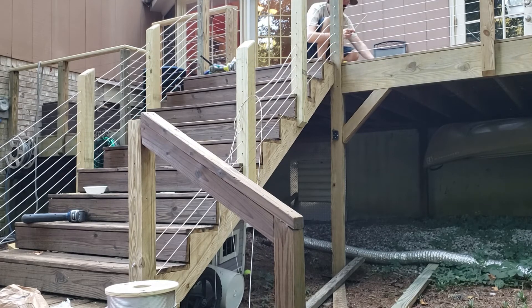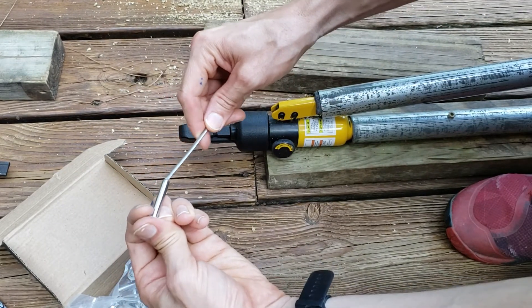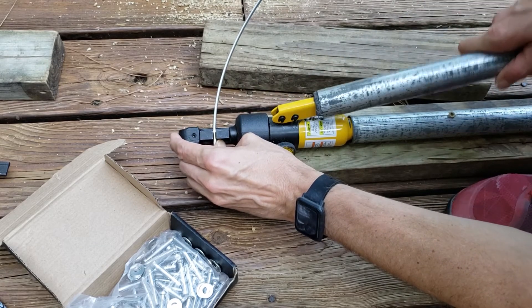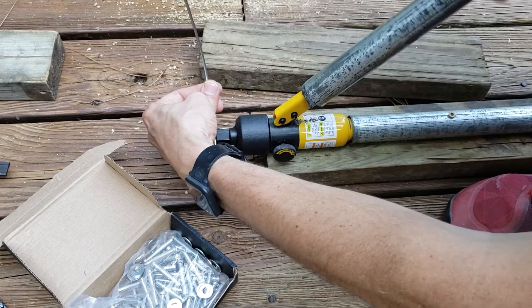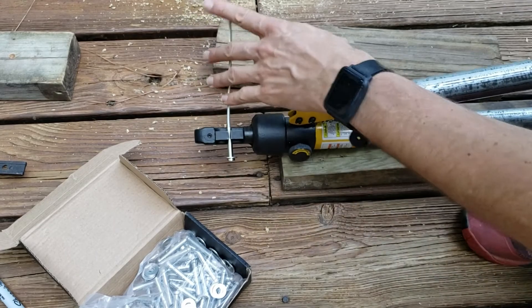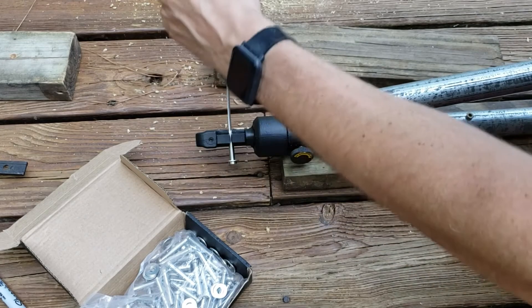When I get to the top I add the swage ball that goes on the end. I take the swage ball, put the washer on, put it on the end of the cable, put it in here and loosely clamp it. Then I hold the cable and bottom out the cable all the way down. Then I start the crimp. I like to be able to rotate the head because the cable is coming down at an angle, so it keeps the cable nice and straight.